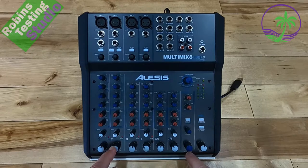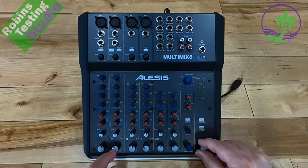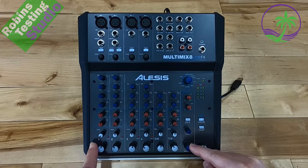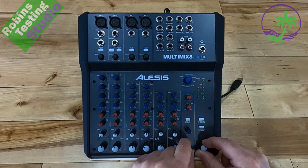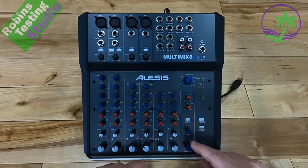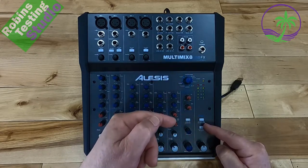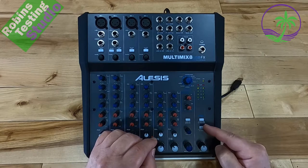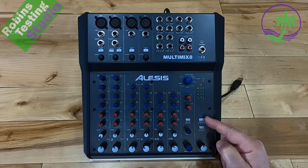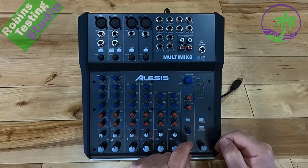There are two more blue knobs — monitor and headphones. Using the button above, you can set main to monitor so whatever is happening in the mix is sent to both the headphones and the monitor. If deselected, the headphones and monitor reference the main lines directly, and they're controlled independently. There are also two buttons for routing the USB audio interface input: you can send the two USB tracks to the main, or use the two-track USB to monitor option — useful if you want a backtrack for yourself but don't want it sent to the mains.